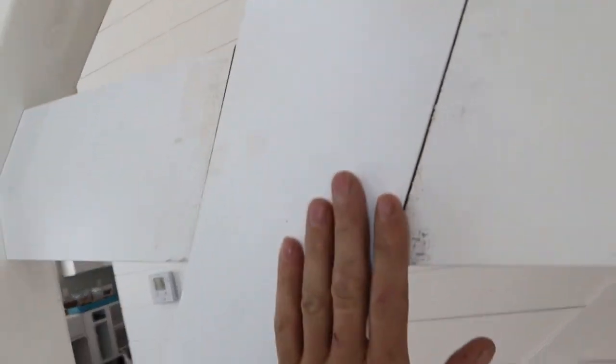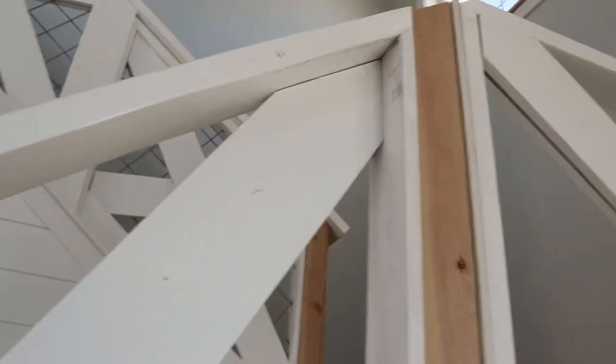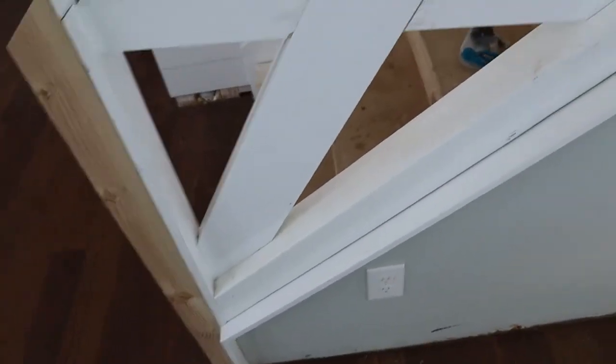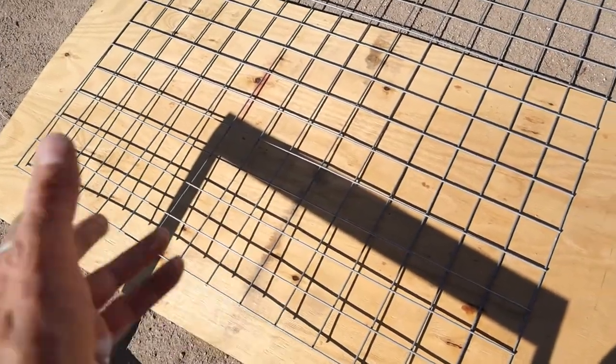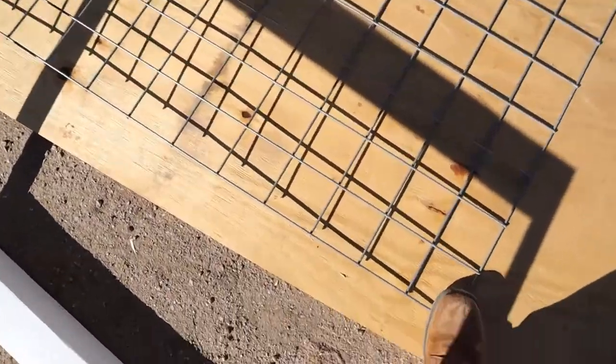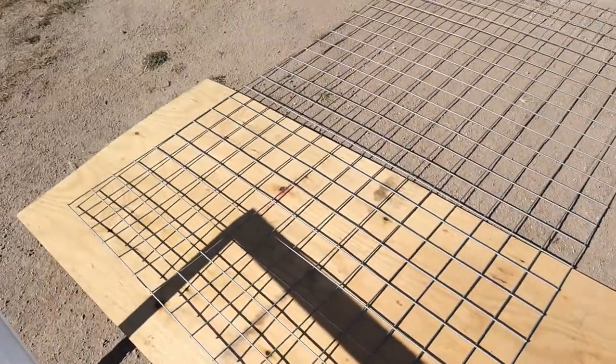We got these notched into each other - they're just sitting in here right now. Now that we've got all these up and confirmed they all fit, we're going to take them all out. We'll take the frame apart and do a dado channel in the four by fours and all the tops and sides to receive our panel. Outside here, these are the wire panels I'll be using - this is called a cattle panel, some places call them horse panels. I got it from my local feed supply store. They are four by four squares, equal from bottom to top, come in 16-foot lengths, welded and really strong.